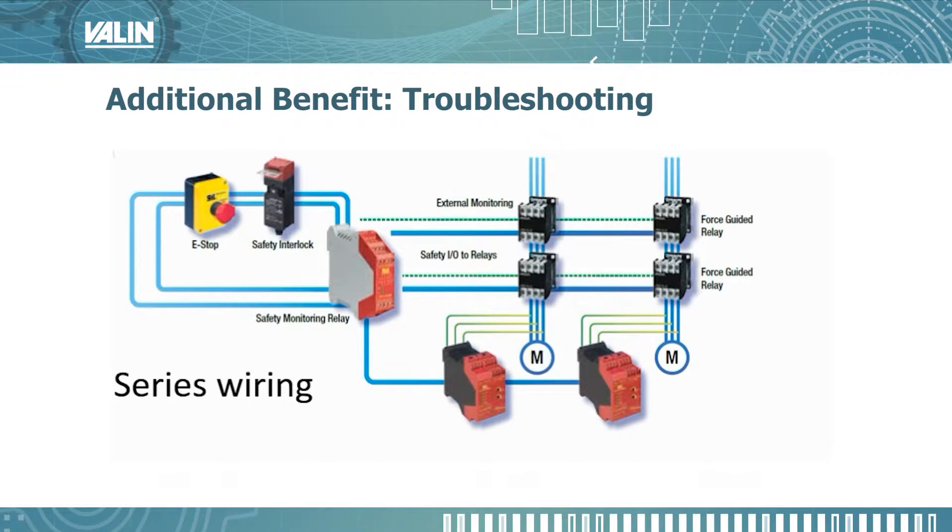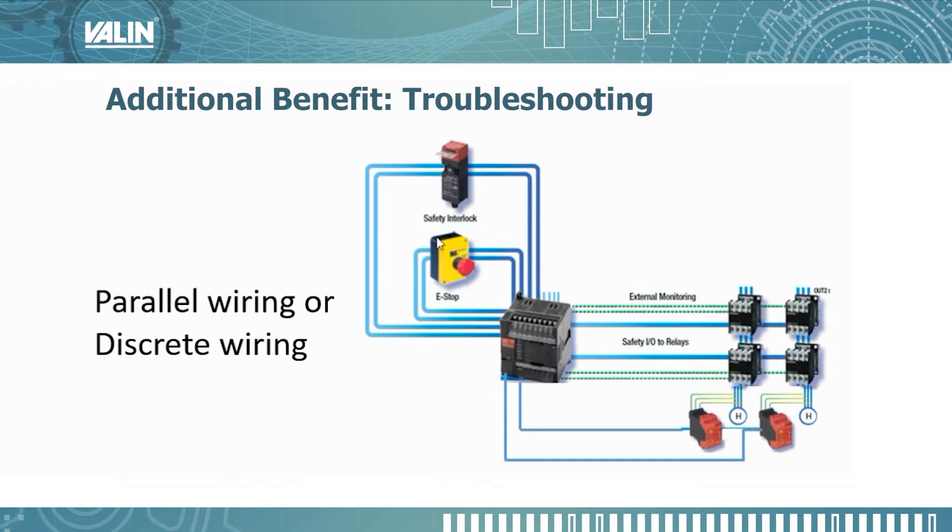In addition to simplifying the wiring, with series wiring, if there's a problem where the safety circuit is engaged and the machine won't operate, the users have to figure out whether it's the e-stop or the safety door interlock. This is not a big deal with just two devices, but I've seen where operators have maybe 10, 12, or 14 safety door interlocks on their machine and the machine won't operate. They have to go test all of them to see which one is not letting the machine run because they're all wired in series — any one of them makes it look like they're all open. With the safety PLC, since everything's wired in parallel, there are going to be indicators on the PLC that you can use to detect which safety device is causing the system to be in a safe state. The operators can look at the safety PLC LEDs for the inputs, or the operator interface will show those discrete inputs and tell which one is not satisfied to allow the machine to run.